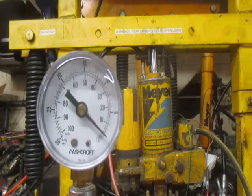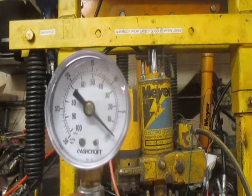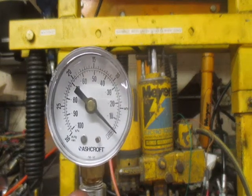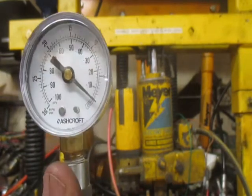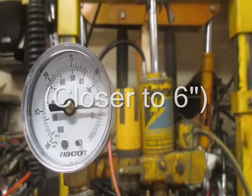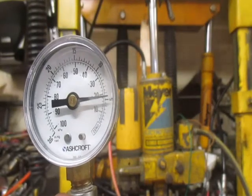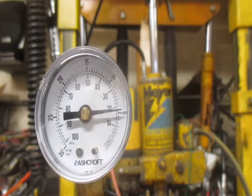This short video explains why E-47s and E-60s take on water. Here we have a vacuum gauge hooked up — I'm going to raise this E-47 and watch what happens. Five inches of vacuum. If that tank is not sealed perfectly, you're sucking water in every time you raise it.